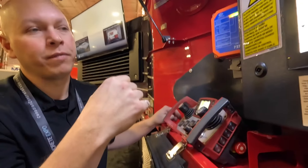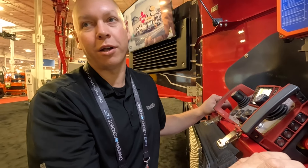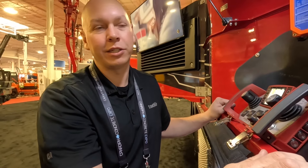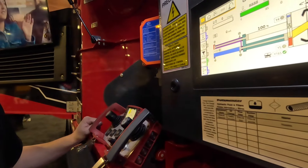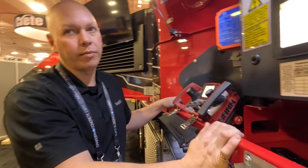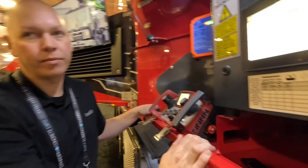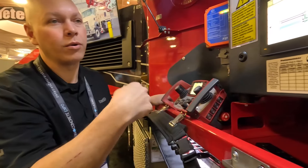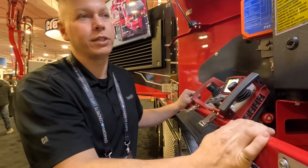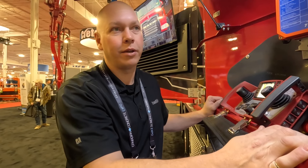If you're having a problem with pumping, you can look at the deck and make sure the lights match what's shown here. For diagnosis, even if the person running the pump doesn't fully understand it, you can call tech support and they can walk you through it. If a proximity switch has a problem and the pump throws a code, that code is available through Machine Cockpit — your dispatch can log on, look at your truck, see active fault codes, and identify issues like a bad Y4 coil, Y5 coil, or rock switch. Your dealer or Putzmeister can also have access if you grant them that.